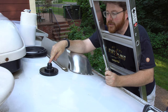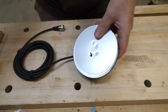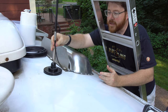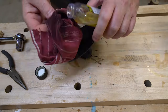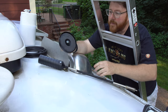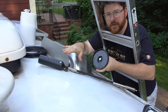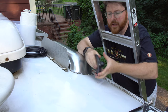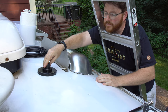Using this CB antenna mount — the threads happen to match. I found this on Amazon for $14 and you can see that makes a really nice spot for it. Since this CB antenna mount has magnets on the bottom, I don't really need the magnets — my Airstream is not magnetic because it's made out of aluminum. So I'm going to use VHB tape all along the bottom here just to stick it to the roof, which I'll clean thoroughly with alcohol. And just because it is a little heavy enough to deform the aluminum on the roof, I'm going to put it over this rivet line here.